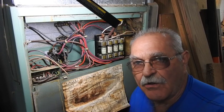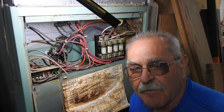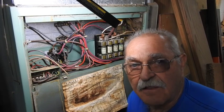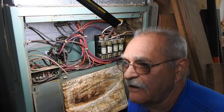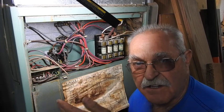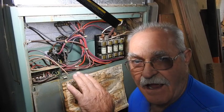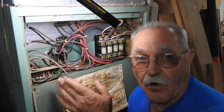That's because of what you've told him over the telephone as far as what the problem is. You have a situation where they say, oh, it kind of cools, but it kind of doesn't. But whenever you turn the thermostat off, the air handler wants to continue running. That indicates some kind of electrical issue. A lot of people don't realize that the heart of the system is actually the furnace, because the control power for the entire system — heating and cooling — originates in the transformer on the actual electric air handler or gas furnace.